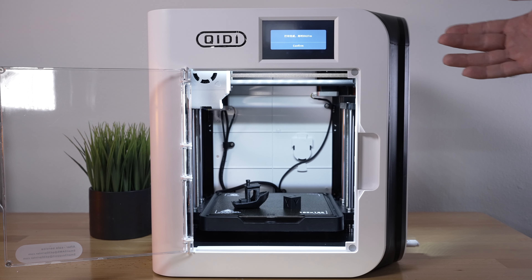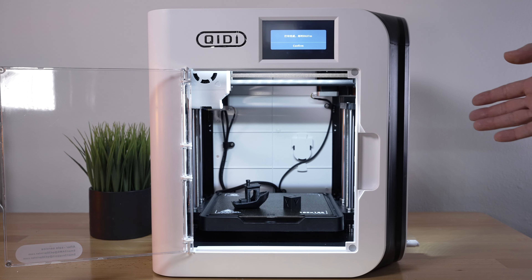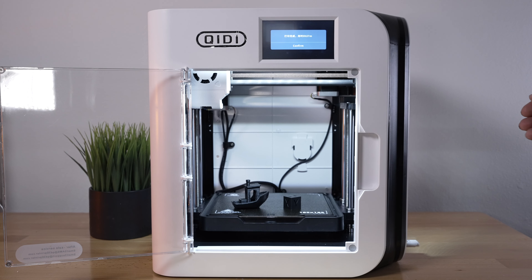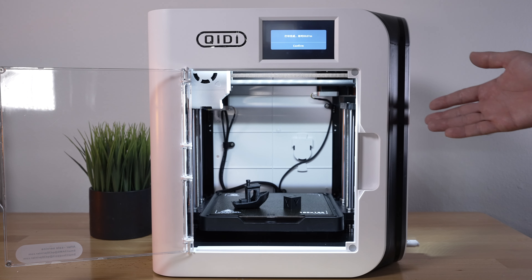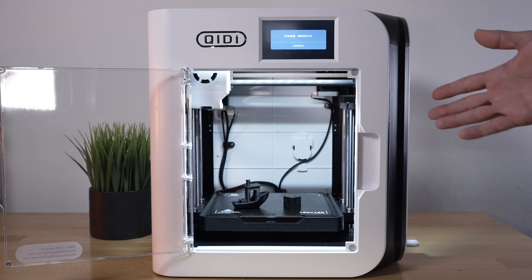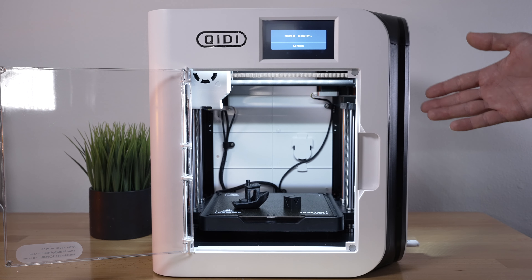Overall a good start, definitely not as perfect as I'd like, but we need to try different settings. I do need to increase retraction a little — there's a tiny bit of stringing — so maybe 1.2 millimeters. I'm going to print at different speeds using calibration cubes as they're quick to print, and that should show print quality versus speed better.